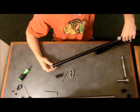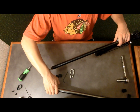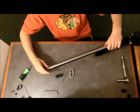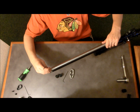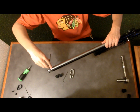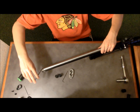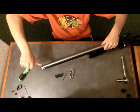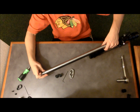There's also going to be a little gap here in between the end and the tube itself, and that's alright because the o-ring is actually going to seal despite the fact that there is a bit of a gap. Next, we are going to take our second tube and simply line everything up, and I need that eighth-inch allen key again and we are just going to screw it in. As you go, you are going to feel some resistance — that is from the screw compressing the o-rings, and that is what you want to happen.